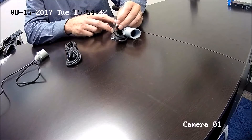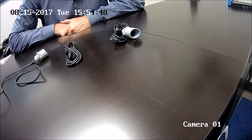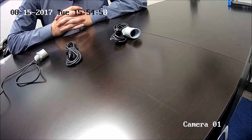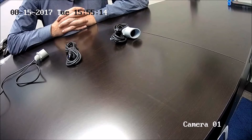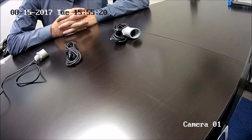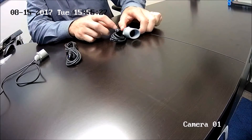Traditionally, wiring a microphone was a big pain. We have another microphone called a pre-amplified microphone — that's a line level microphone where you actually have to power the microphone in addition to running an audio cable to the camera. It was easy enough to run an audio cable from the camera to the microphone, but the pain was having to run an extra cable from the nearest power supply to the camera. This new mic solves that problem.